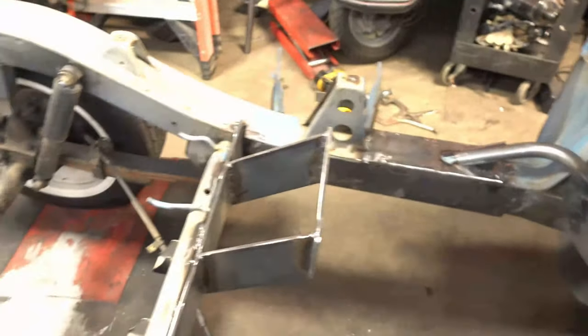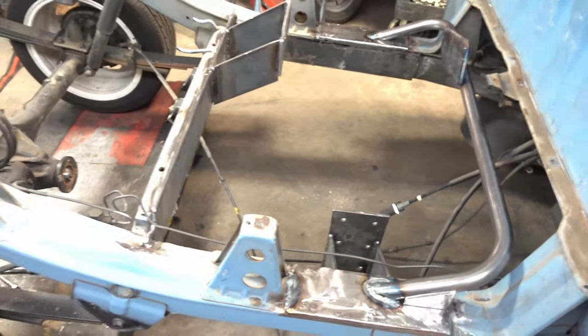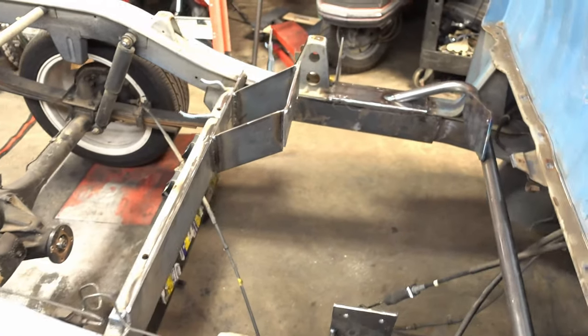This portion we'll just paint all black. This thing kind of was a bummer because my plasma table isn't here and it's going to be out like another four weeks. I'm not going to wait on anything because it's going to put the project too far behind. We've decided on the gas tank — rather than cutting the gas tank and putting the pump in it, we're just going to put the tank back in the truck and run an inline pump on a relay with a fuel pressure regulator, and we're going to make a return system. Carter's going to work on that. I'm going to be gone all next week. That way it's constant flow. Typically they don't have a return at all, so we're going to do a return on that from the Hayabusa throttle body. Carter's ordering up all the wiring components, connectors, wiring looms and everything to get this wired in.